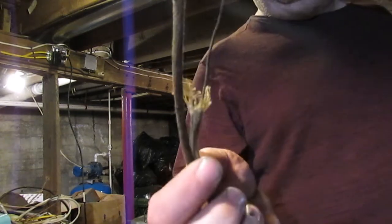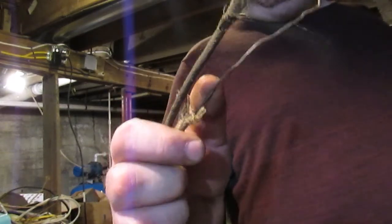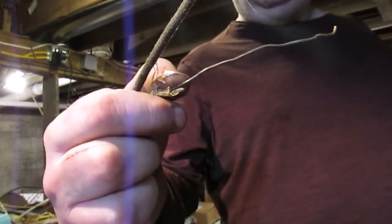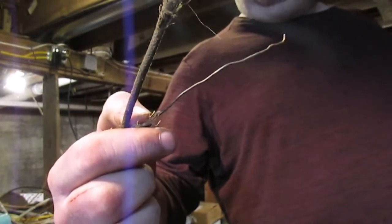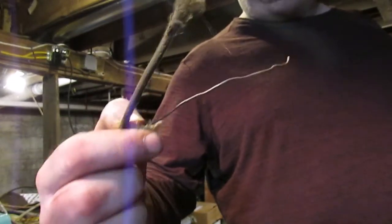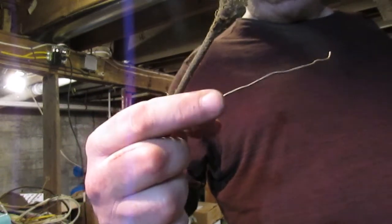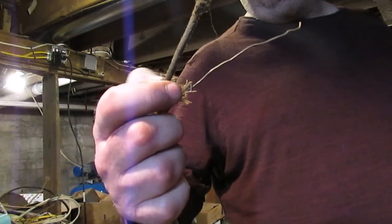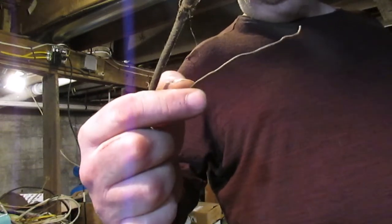This one is pretty badly deteriorated, as you can see. Another thing you would notice is that this wire is actually covered. This is tinned wire. It's copper wire, but it's got a tin coating on it that protected the copper from the chemicals in the vulcanized rubber, which had a tendency to corrode copper. And of course, the tin coating on the copper lent itself to soldering too.